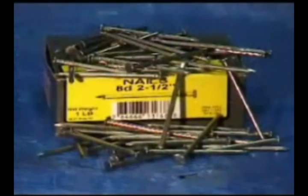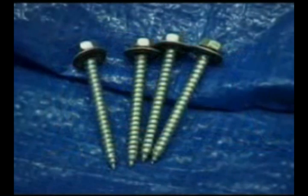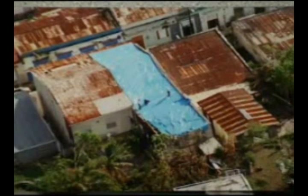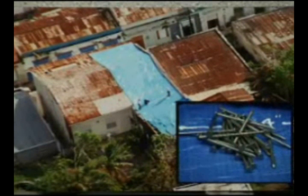Note that galvanized steel 8-penny nails shall be used as fasteners, spaced not more than 24 inches on center, along the structural use panel or furring strip. Galvanized self-tapping number 10 screws, 2.5 inches long, with gimlet point shall be used to anchor furring strips directly to corrugated metal roofing only when there is no existing rafter available to provide anchorage. Otherwise, for corrugated metal roofing, galvanized steel 8-penny nails shall be used.